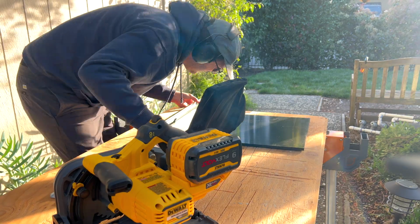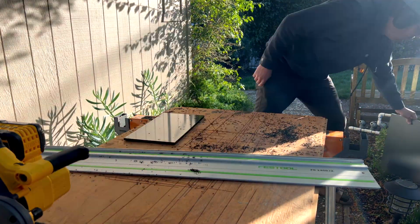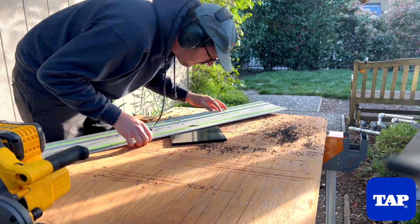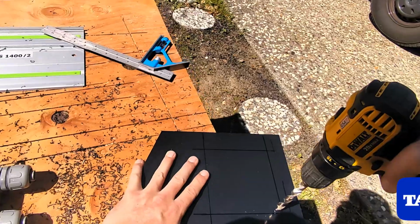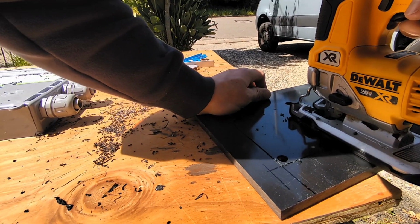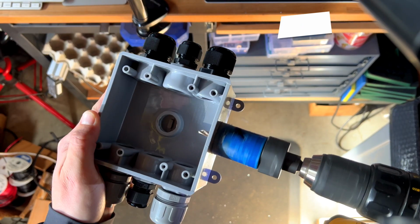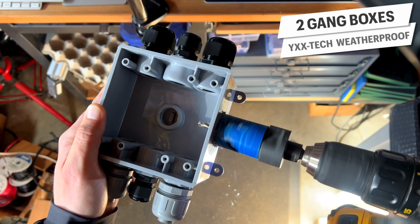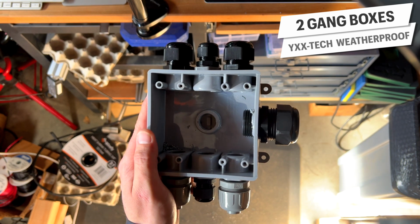I decided to make some junction boxes on each side of the van where we ran that conduit. I used a sheet of 3/8" ABS that I picked up locally from Tap Plastics. It's great because they cut to size right there on the spot. The nice thing about ABS is it's strong, durable, won't rot, and can be processed with normal woodworking tools. On the driver's side junction box, I had to drill an extra hole in the side of it, but nothing a hole saw can't handle.